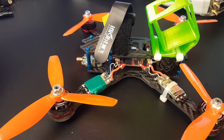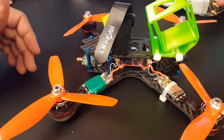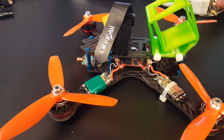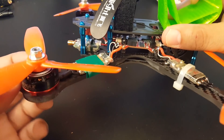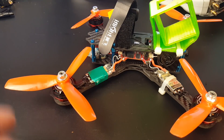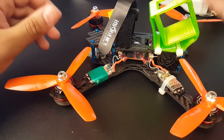However, it did have a little bit of noise, but it's actually super flyable. I don't even think you need a 1000 microfarad low ESR capacitor — maybe like one 330 or one 470 microfarad would clean it out. I was impressed; I did not expect this. I was thinking I'd probably fly it for 30 seconds, not be able to see, land it, add a low ESR cap, and come back for another test. But if I add a low ESR capacitor, this would be an absolutely perfect feed — and this is direct feed from the battery. We have it set up on Emax 2205S motors, which have strong magnets, and usually motors with strong magnets tend to have more noise. So it passed with flying colors. I'm going to show you the footage right now.